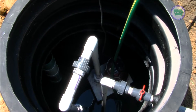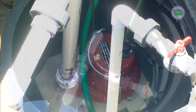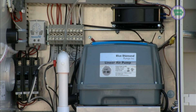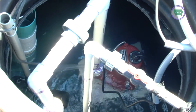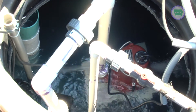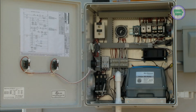We now have a shot looking down inside the treatment tank. Inside this tank we have installed an air diffuser, so that there is a little blower inside the control panel. That blower will force air down into the liquid, add oxygen from the air, and mix up the solution so that it is thoroughly and aerobically digested, doing a complete job of removing the organics and tying up the solids. That happens on a cycle basis over a 24-hour period.